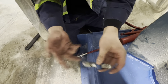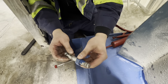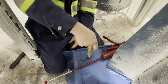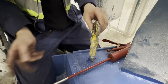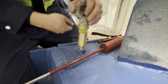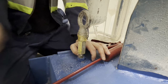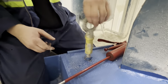Someone used the wrong size of bolts for this application, so we're taking them out and putting different bolts in — you don't really have a choice. If your wedge anchor is spinning and it's still in the hole and hasn't bottomed out, you can double nut it or hold it with a vice grip and turn the nut. That'll force the bolt up because the nut can't force the wedge down into the hole.